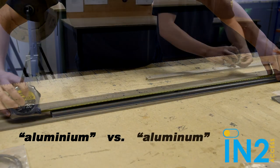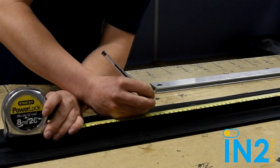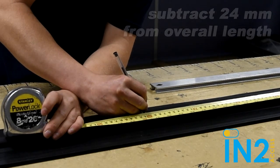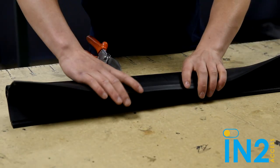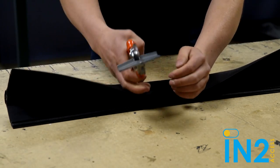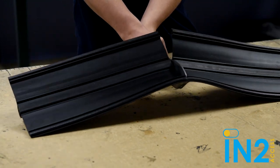You're in the UK now, it's aluminium. By the way, it's important to remember to take the total length and subtract 24 millimeters to accommodate the end caps, which Jack is doing right now. Then simply fold the rubber in half and use the rubber edge cutters to cut to length. Okay, one swift cut Jack, or two?